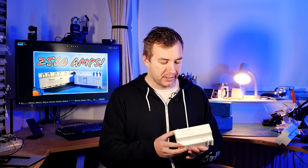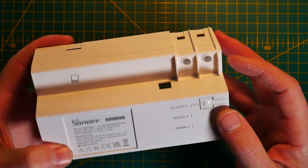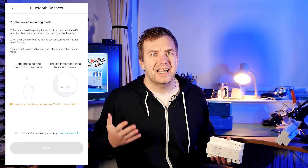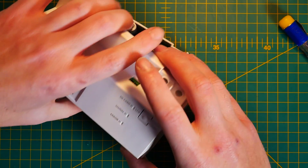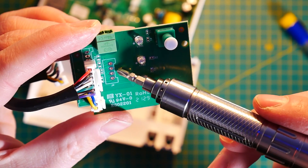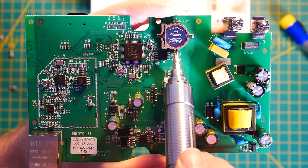Apart from the button, you're also going to see the SD card slot — we'll touch on that a little bit later — and a two-wire connector used for the RS-485 protocol, which highlights the industrial orientation of this device. Pairing this unit is very simple: open the eWeLink app and use the Bluetooth menu, which indicates that inside we have an ESP32 device.